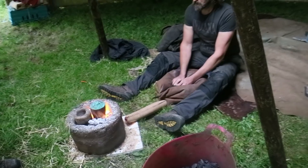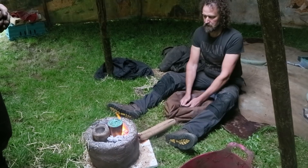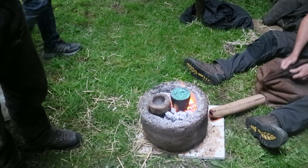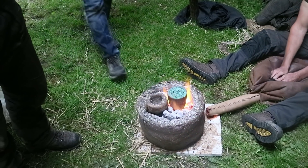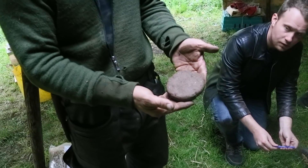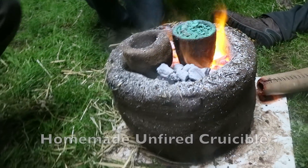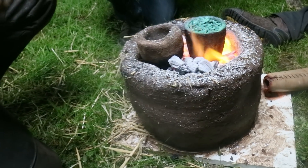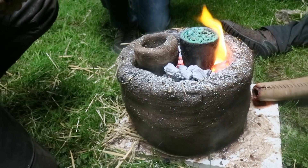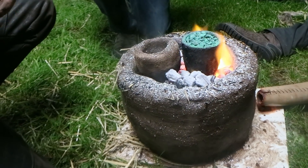The other trouble with malachite is when it gets hot it begins to spit. You'll hear little pings — it's like it's shattering and they can leave at fairly high speed. That's why I'm making a lid for it. I'm breaking all the rules with that much grog — you can dry it straight in the fire, you shouldn't be able to, but there you go.